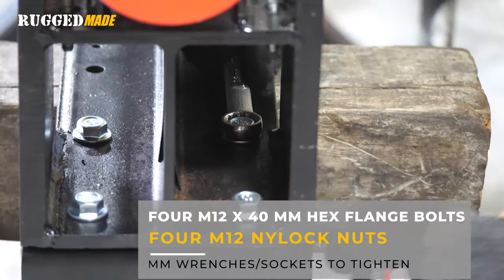Now that we've run the hydraulics and there's fluid in the hydraulic cylinder, pump, valves, and hoses, we can top off with the eighth gallon of hydraulic fluid up to the fill line. Note that the main splitting cylinder should be in the retracted position for this check. The 300 series comes standard with a slip-on four-way blade. A really cool feature of the 300 series is the stroke restrictor — this plate allows you to use the detent of the valve and save time by having the rod only come back to the 20 inch position when splitting 16 to 18 inch rounds instead of the normal unrestricted 24 inch position. Extend the cylinder to reveal the holes in the beam and secure it with the big wing nuts.